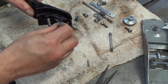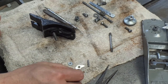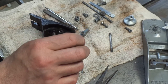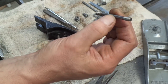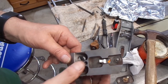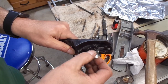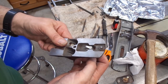There was also play side-to-side in the opening where the yoke goes, and I'm going to try to compensate for that with these two washers. I'm going to try to make a little bit of a sandwich and get the pin down through while keeping the washers in place and without destroying this aluminum bushing that's inside of the brass bushing. I put a coat of WD-40 on everything and wiped it off, and then I put a coat of wax on everything and wiped it off.